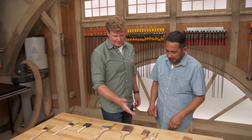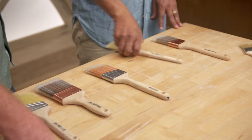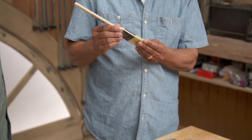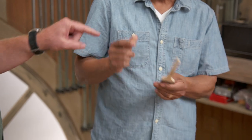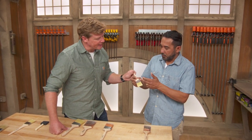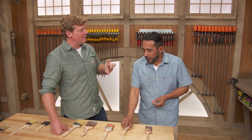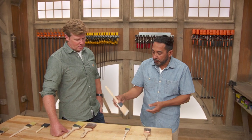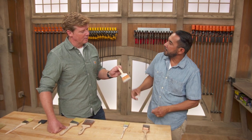If you're painting the exterior of your house — the siding or the clapboards — you're going to use a flat brush. If you're doing a deck, you'll use the same flat brush. If you're cutting in and need precision, you're always going with the angle brush. Now what about size? You always try to match the size of the brush with the surface you're trying to paint. Something like this inch-and-a-half sash brush will do the work for painting a window sash with little wood muntins. If you're going to do the casings around the window, the trim, the baseboard — the two-and-a-half-inch brush is the best.